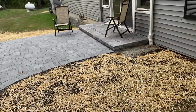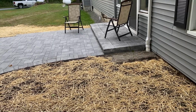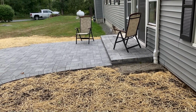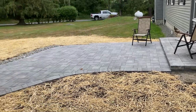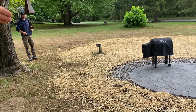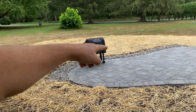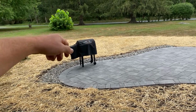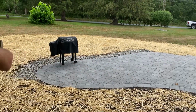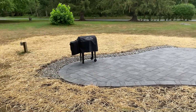Look at the beautiful colors on these Cambridge pavers. We built this thing to stand the test of time. This thing is set up well. The house is protected. There's drainage that runs that way. There's drainage that catches over here. So if they get heavy downpours coming this way, we got drainage right where that Delaware stone is. That's underneath, that skirts it over there. Plus we got our pitch going this way, which captures that there because it's kind of a pinch point.